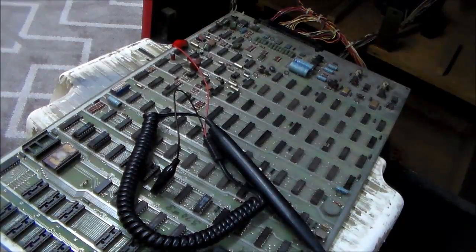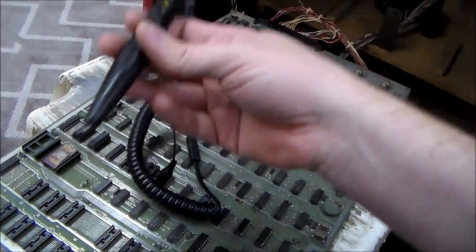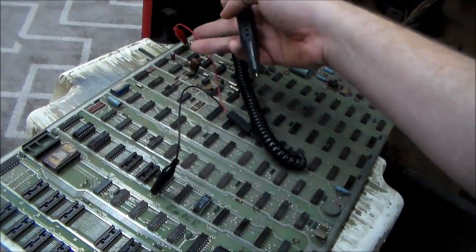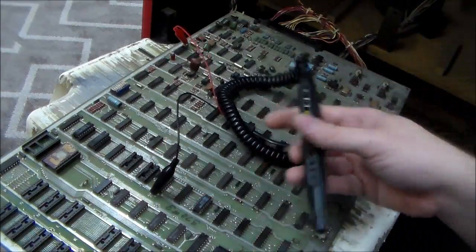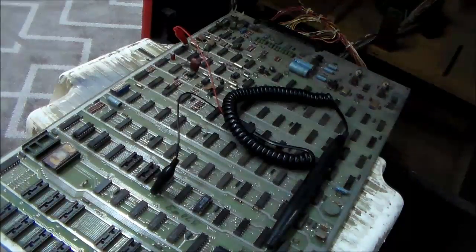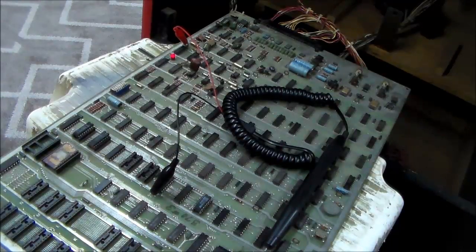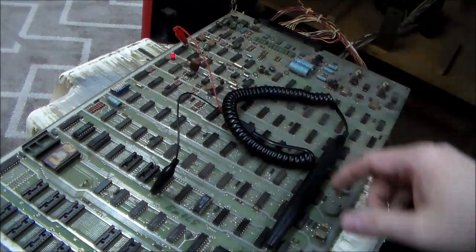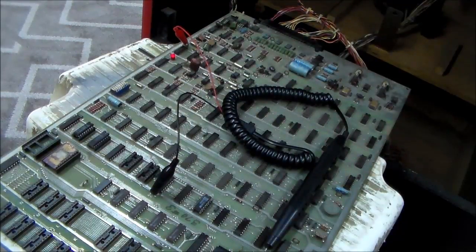All right, folks, so we are back. So I have taken a logic probe, which is about a $10 or $15 tool, very cheap, right? And I connected it to the ground and to the 5 volts, right? And now we're going to turn on the game. Now, when you first turn it on, see how the sound sounds different? It's because I didn't hear the first couple beeps because we had just turned it on. So to get the proper thing, you need to reset it once.